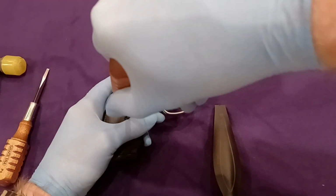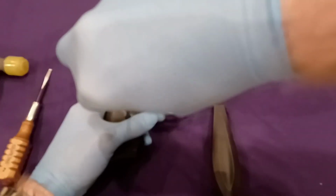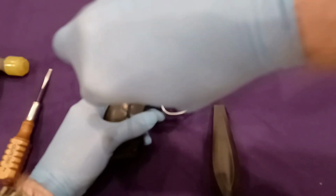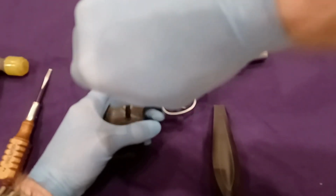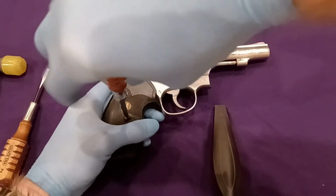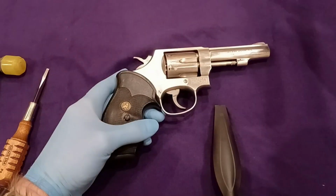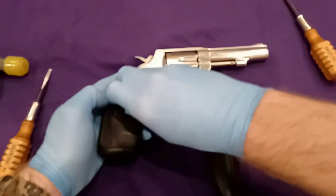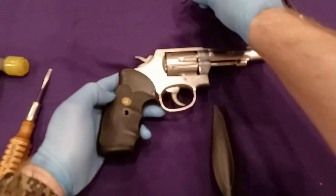And you use your fingers to twist the screwdriver, and you kind of balance it in the center of your fingers. Take that screw off. See, that grip's not moving around. I'm maintaining my drive angle, and the backstop are my fingers, so there's no wobbling going on there where it's going to goober the head of the screw. And there we have it. We got the screw. It's out.